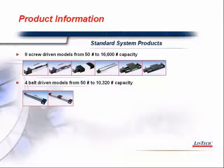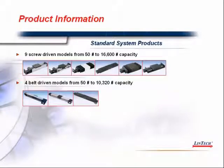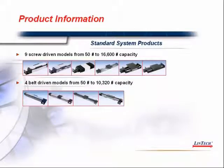The 180 series is a belt-driven version of the popular 170. It offers excellent load capacities and can be combined with the 170 to create multi-axis systems with belt and lead screw combinations for the drive mechanism. This is especially valuable for Z-axis applications so that an Acme screw or brake can be used to prevent backdriving in a fail-safe condition.